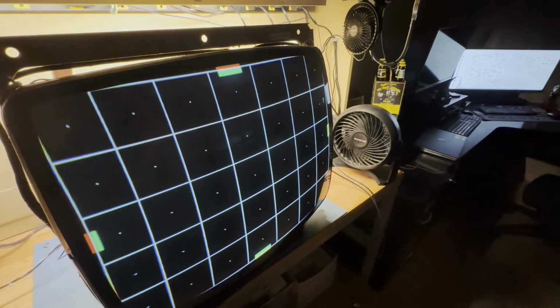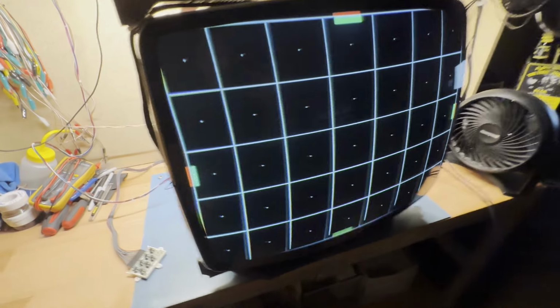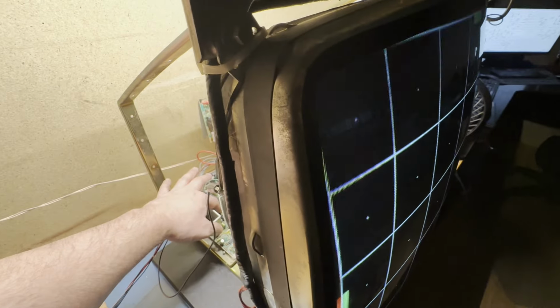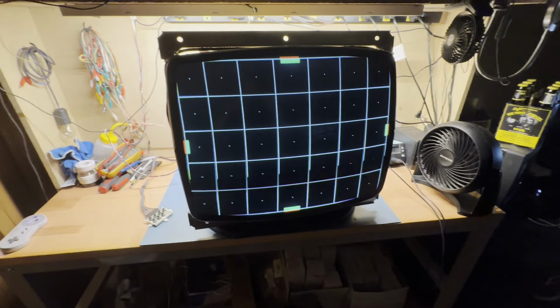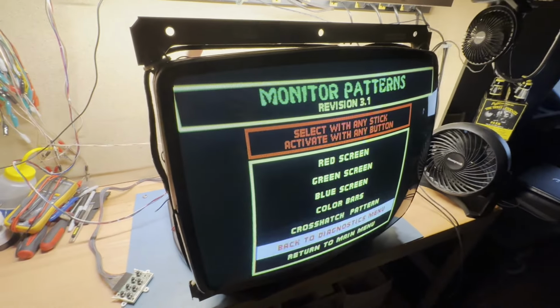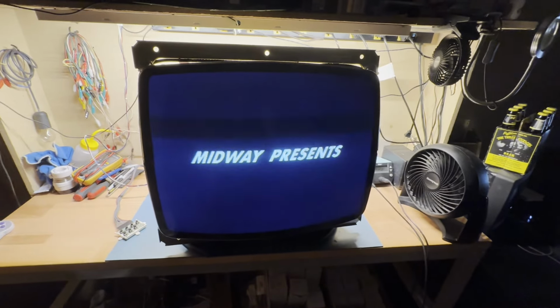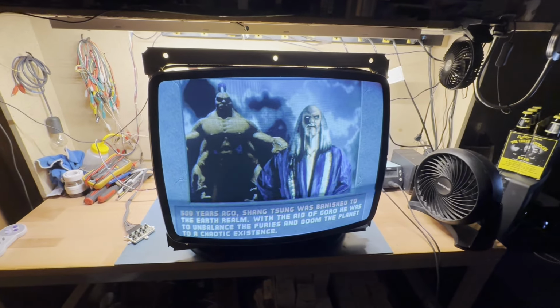And you can see I still have the schematic up on the computer over there. But all right, yeah, so I need to fix the solder joints on this transistor here. And if I move it back, see, yeah, so I'll fix that, no problem. But for the purposes of the video, we have this repaired. So that's it. I'll get that transistor fixed, and otherwise, yeah. And we can see how well this looks with everything all adjusted, which I had already done previously. We got our blue background. That means it's adjusted properly for blue and looking good.